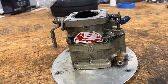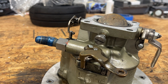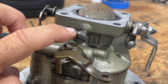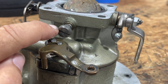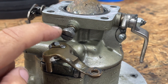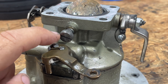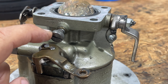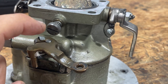We'll install the overhauled carburetor this morning and set up the idle mixture. For those who are going to do this yourself, here's a little hint: when you're setting up the idle mixture, here's your idle screw on the back side of the carburetor. If you're very careful and tie your aircraft down with somebody in the cockpit, you can actually come up from underneath the aircraft with a long flat-bladed screwdriver and turn this to adjust the idle. Make sure your engine is nice and warm and you want the idle to be less than a thousand RPM — above that you're not on the idle circuit and this won't have any effect. Somewhere around 700–800 RPM, turn this screw all the way in and you'll hear the engine start to wind up a little higher, then start to stumble. Back it out a little bit till it's smooth. Going the other way it'll be rich and it'll start to stumble.